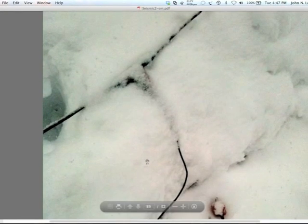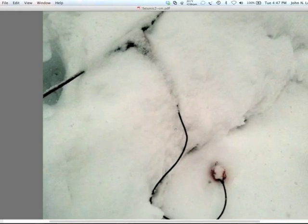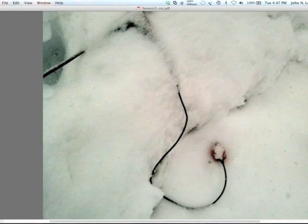Here's an example of a bad geophone plant. It's snowing at the time. The geophone's plugged in there. If there's too much water or mud, especially with some electrolytes in it, then that can cause a short across the geophone terminals. That's why we have swamp connectors, if we're going to be working in very muddy areas. But we didn't have those on this cable.